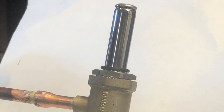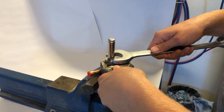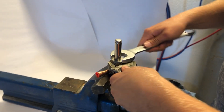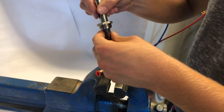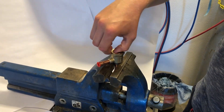We are now ready to disassemble the valve. Carefully loosen the armature tube and hex nut assembly by using two wrenches, as seen here — one wrench for loosening the assembly and one wrench for counter-holding the valve body to avoid stressing the valve connections and the piping. Then unscrew and remove the armature tube and hex nut assembly, as seen here. Remove the armature and armature spring from the armature tube. Carefully remove the metal gasket from the valve body.